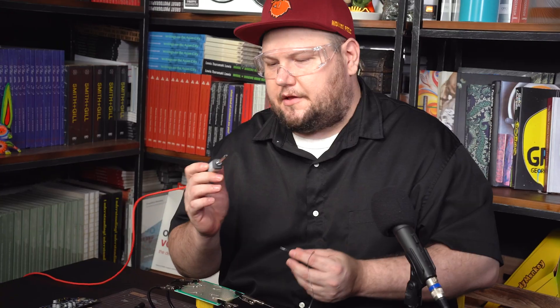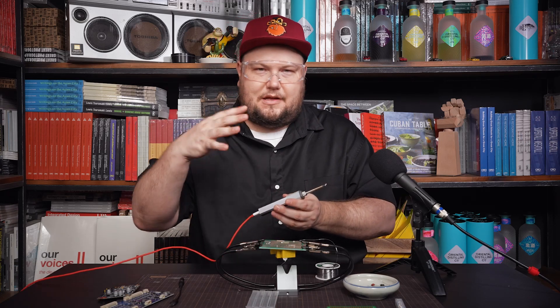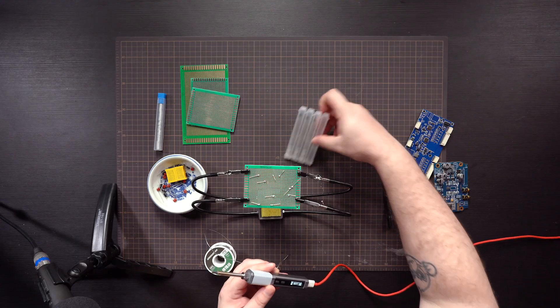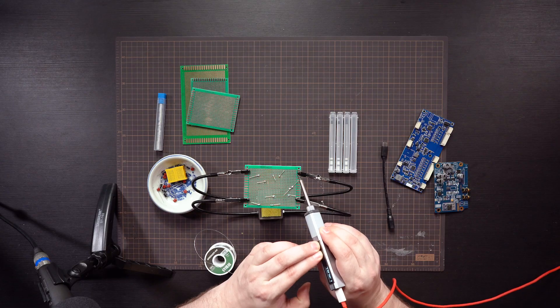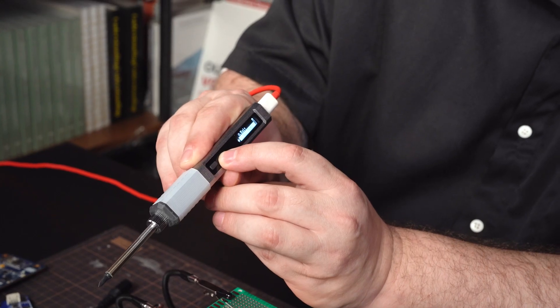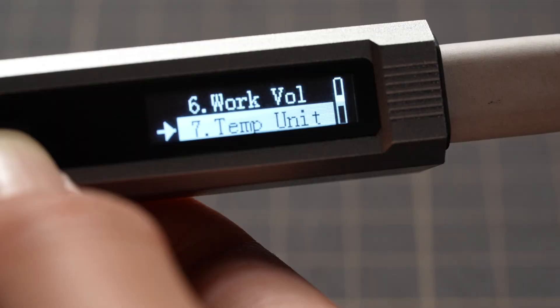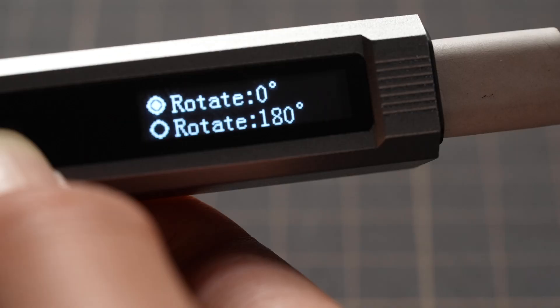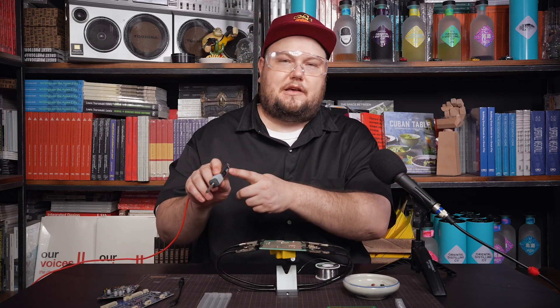For my first time doing soldering, I think this tool is very convenient and very easy to use. With that 150 watt power, it makes the tip lightning fast. It's cool that it comes with four different tips — whatever you're trying to solder or do on your personal projects, everything is provided for you. This soldering pen has a very nice menu. Hold both of these buttons right here, the menu pops up and you can adjust it. You have volume control, sleep mode, standby mode, temperature units, and how many units it goes up and down. You can adjust languages and rotate the display — maybe you're left-handed as opposed to right-handed. If you were left-handed, you could flip the display so you can see it while you're working.